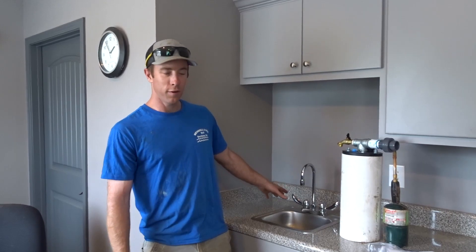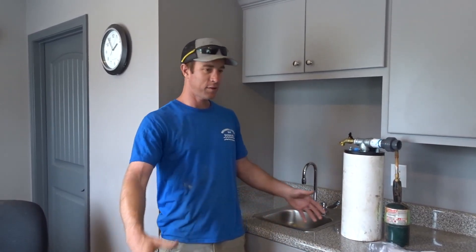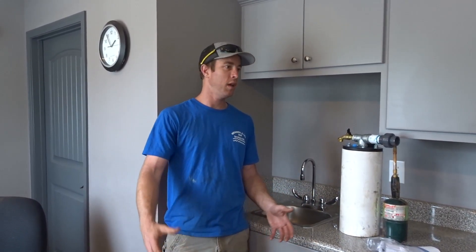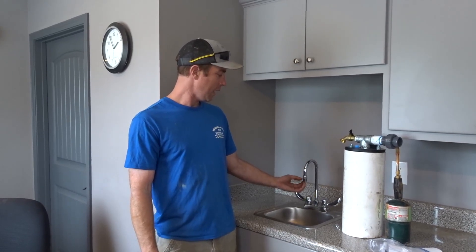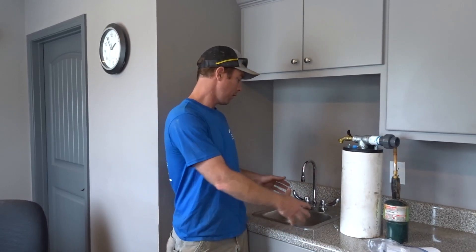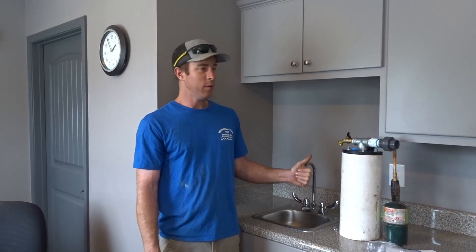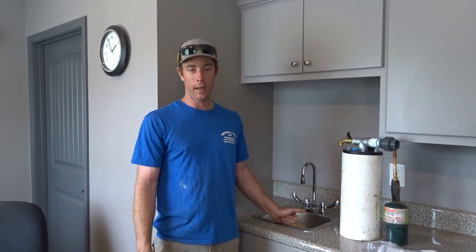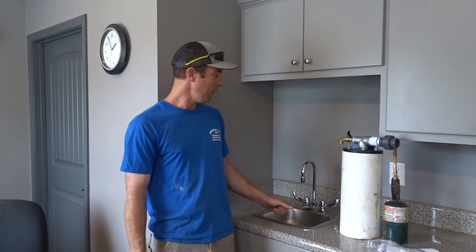The first inclination is going to be to go to the kitchen sink — this is where you drink your water from, you're washing dishes, and obviously this is our little sink here in the office. Most of you have a bigger kitchen sink. The first thought is your best place to take a water sample is at the kitchen sink. No, that's not correct. There's always bacteria that can hang out in these nozzles, in the aerators, and around the sink itself. This is going to give you a false reading. I can't tell you how many times people are buying new houses or randomly testing their water, they give us a call saying the water sample came back bad — came back with coliform bacteria. The first thing I always ask is where did you take the sample, and about nine out of ten times it's at the kitchen sink.